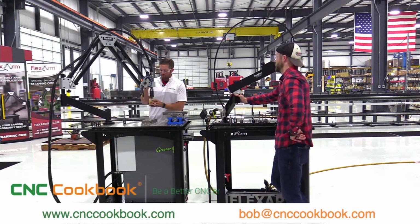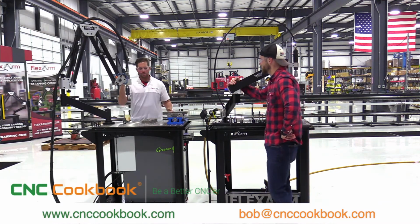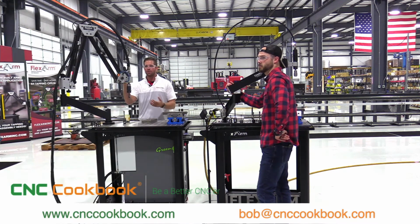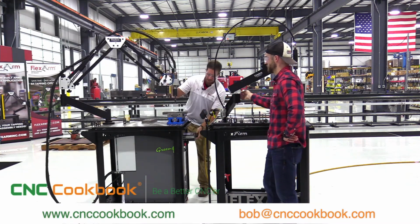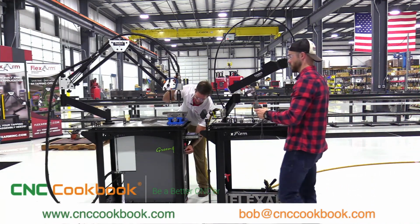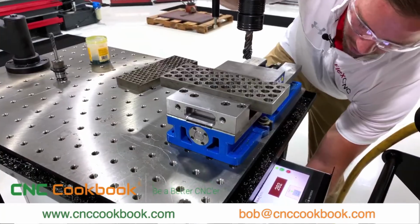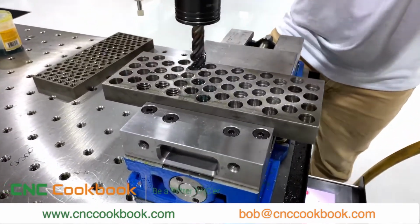Yeah, so the next thing that we're going to showcase here, Eddie, is our 3/4-10 tap, just to showcase whether you're getting into the smaller stuff or the slightly larger stuff, there are definitely solutions out there to help eliminate tap breakage in your parts. Again, it's a 3-flute OSG tap, blind hole, mild steel. We're going to run this at about 200 RPM, just to show the example of the larger tap sizes. Again, we'll just articulate the tap over the part.